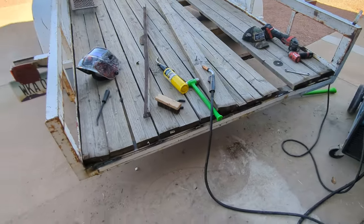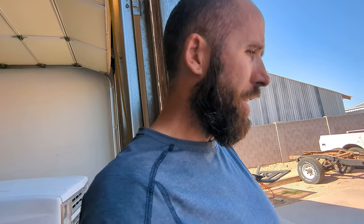All right, top part is welded up. No, I'm not going to zoom in on my welds — I'm a really good welder. This is embarrassing, but I'm having trouble with the settings on this machine. The knee hurts, the back hurts, there's a lot of contaminant I'm not able to get off, glare from the sun was in my eyes — it's cold outside, little shrinkage, you know. It doesn't look good. I preheated it, not getting enough penetration — just too much crap on here; it wants to burn up the wire rather than going in. It is what it is — it's attached. I'm going to clean up the underside; that should be easier. I got some dimes on the top, they're just really fat dimes — like caterpillar dimes.